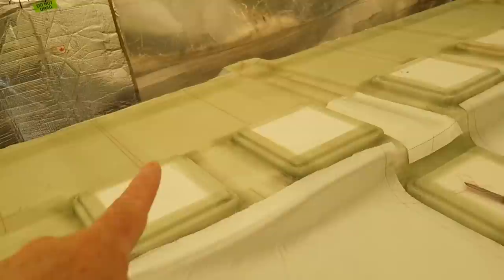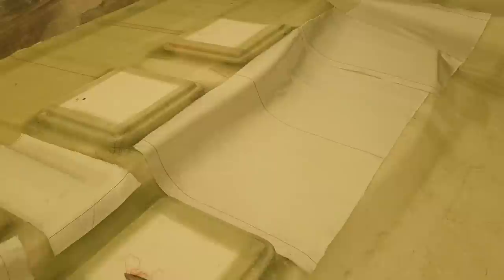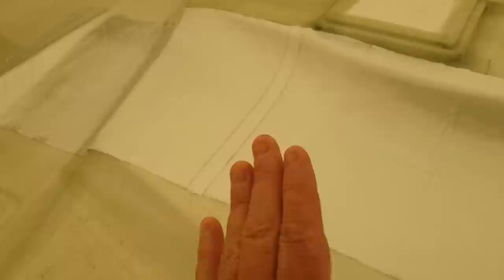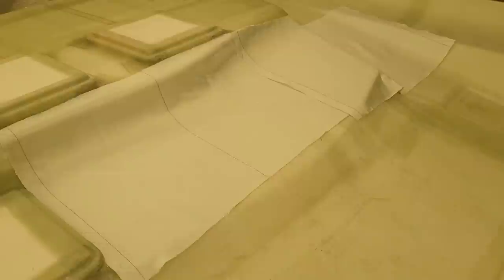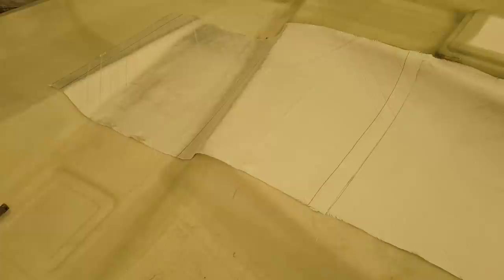Yesterday afternoon I completed the final layers here, so we're ready for foam on that section. Now I need to do this area as well — going another layer of 600 double bias across the front and then a layer of 300 CSM. The 300 CSM is very important before integrating foam, particularly when hand laying, as you want surface area to hot-coat it onto. I love the 600 double bias — you can lay it flat and virtually eliminate air bubbles before you start, using a dry brush to consolidate it down.